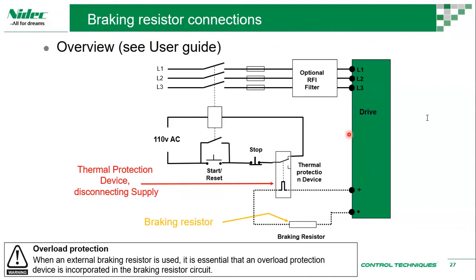If you imagine it as a switch, yes, you can switch on the other side. But when it's on the semiconductor portion, we need to bias the transistors and so on. So in that manner, the load is to be on the collector's end. Your DC positive is always on the top, then your resistor, and then your transistor. If it's a PNP or P-channel MOSFET, then we can switch it on the positive end. Okay.